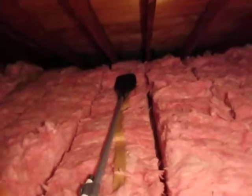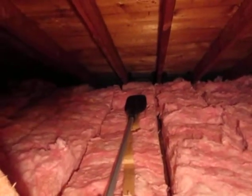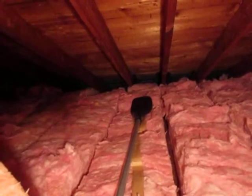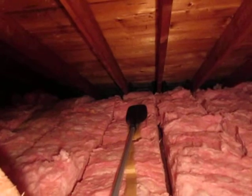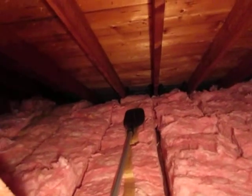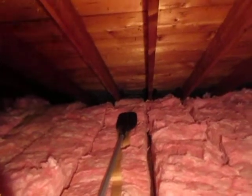I really can't see it too well, but at the end of the insulation there's a black baffle that's stapled into the roof. The baffle is used to keep the air circulating around the insulation. We don't want the insulation blocking the air coming up from the eaves and going through the top of the roof here.